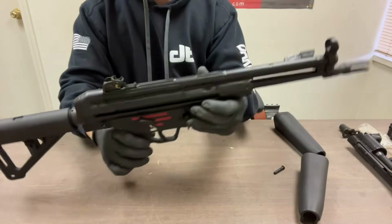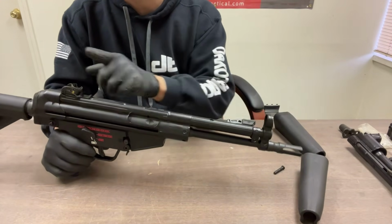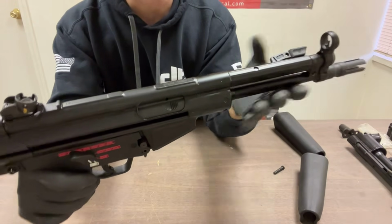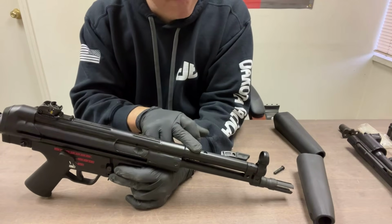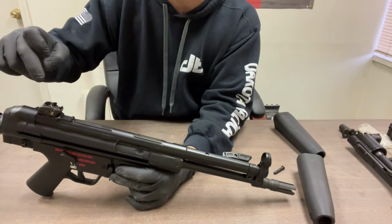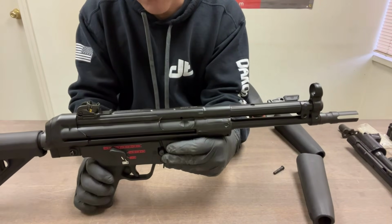Now, if we were to center this rear sight and then retime the front sight to match a center, it would actually correct the tube being off center in the front sight. So my conclusion is that the tube is welded straight, but it gives the impression that it's welded crooked because the front sight is actually canted. And again, that's evident by the rear sight base having the windage shoved all the way over, and I did confirm that with a laser bore sighter.